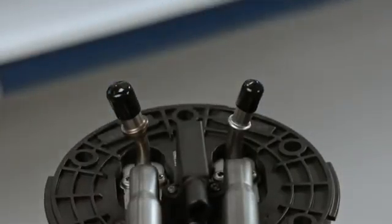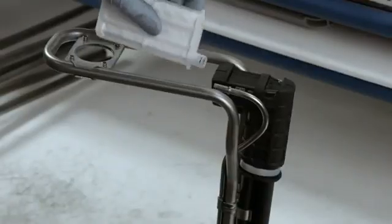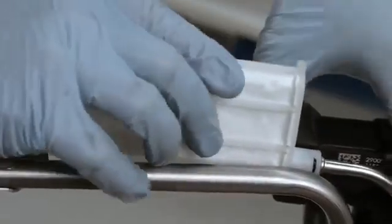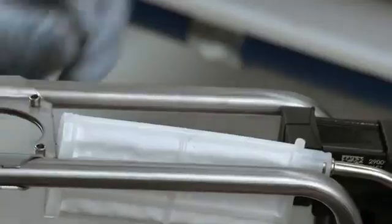He attaches a nylon filter to the siphon tube, securing it in place with a retaining clip. As the siphon tube draws the DEF from the holding tank toward the sprayer, the filter removes contaminants such as sand.